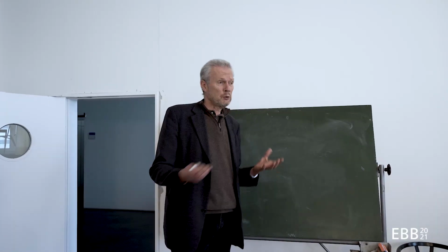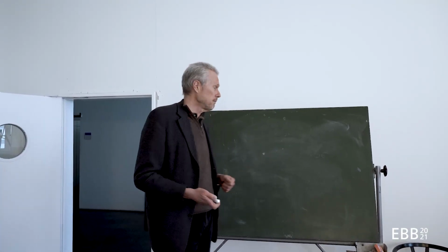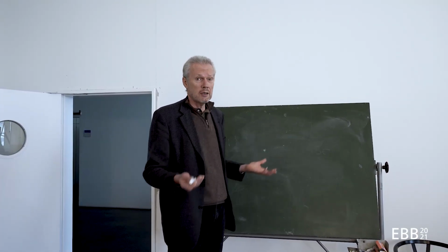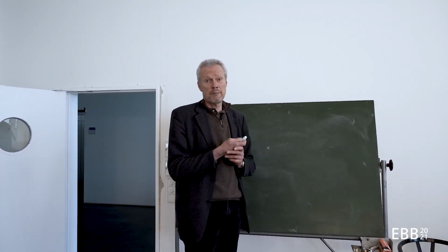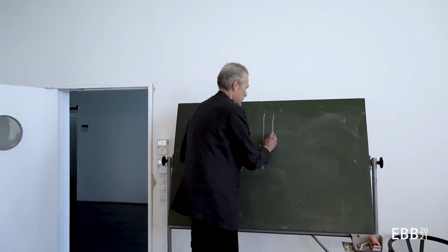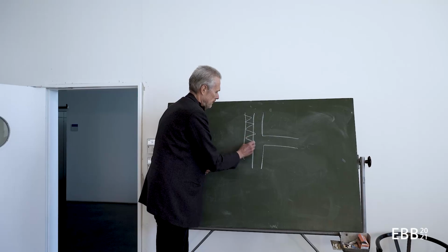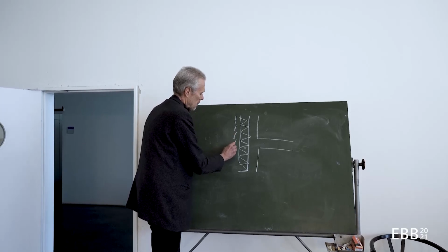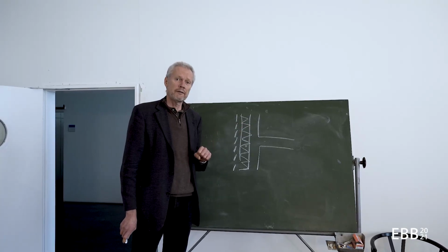And as you remember, we had a vertical load-bearing part already. So this can be the facade actually. If I'm making my building out of lightweight bricks, the load-bearing part will be an essential part of the facade as well. And what I also can have is a load-bearing structure, a very current situation. And then I will insulate this, and then I need some sort of cladding for the insulation. So this is what we have very often.